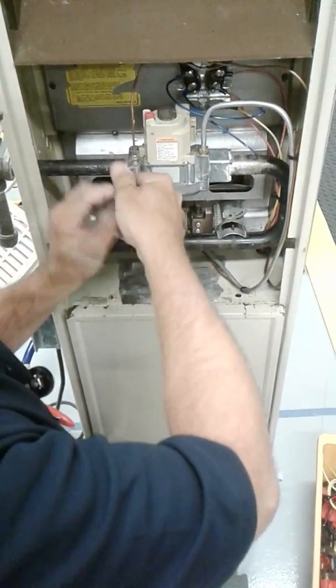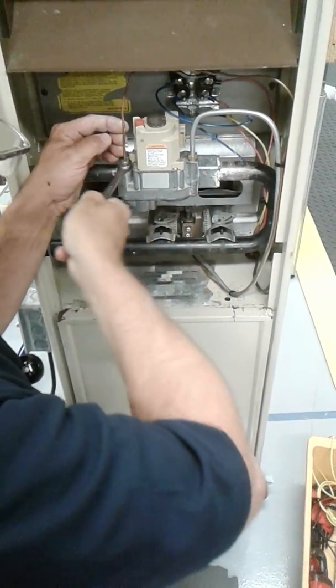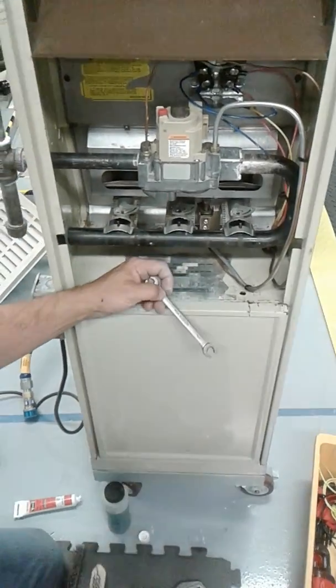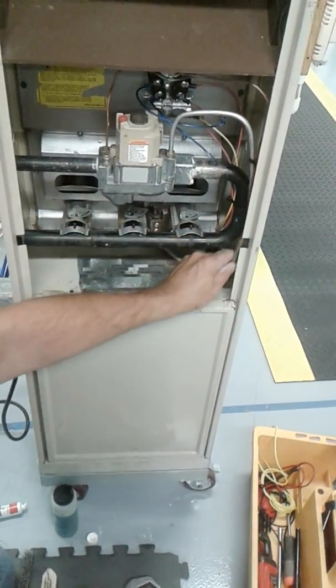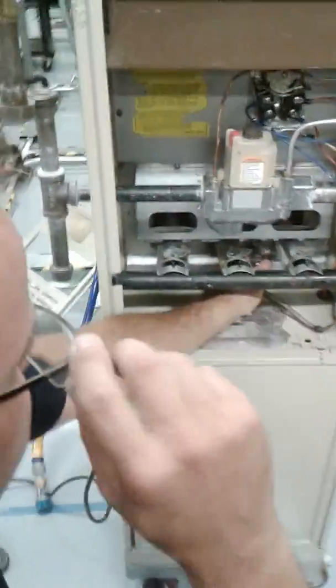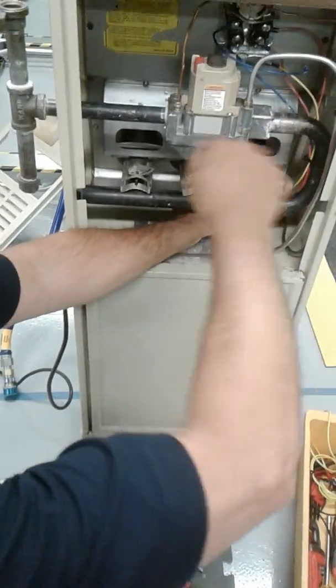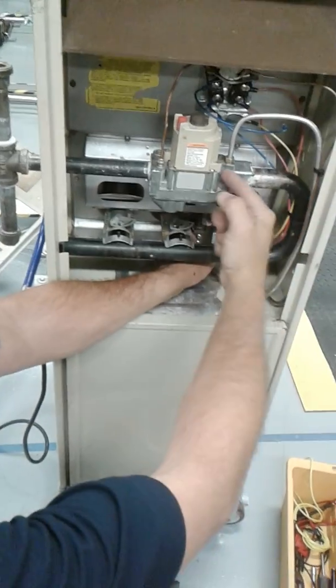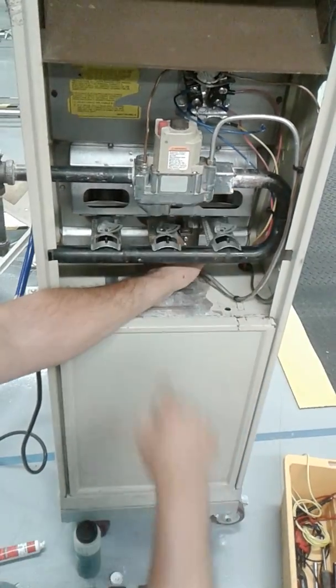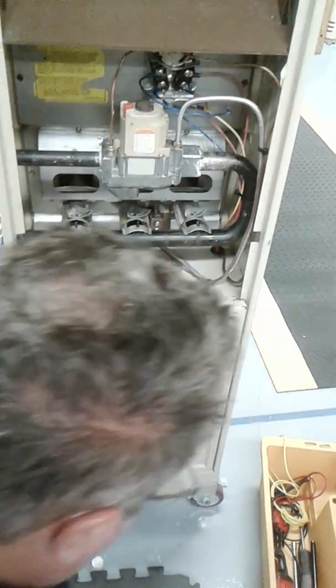Okay. So the fittings that we have to change for the pilot, the compression fittings? Say that again? The compression fittings, the brass ferrules, what about them? Those we have to change? No, you do not. The only time you have to change these fittings is if you replace the aluminum tubing, because they're affixed to it. They're just stuck to it. Once you put them on there, they adhere and break off, and the bottom piece stays stuck to the aluminum tubing. But if you're just going to reuse it, then you don't have to take those off.